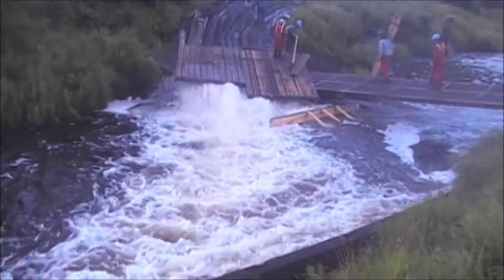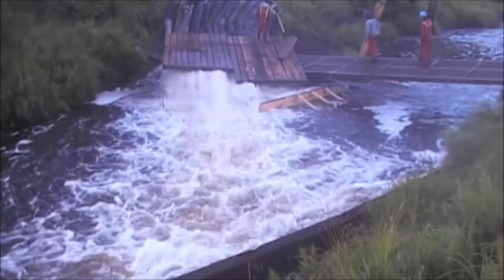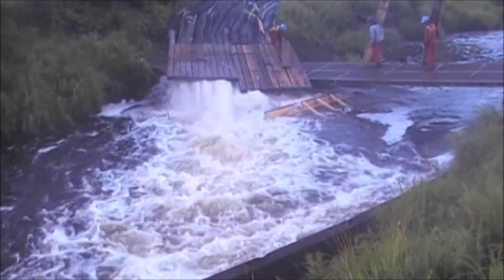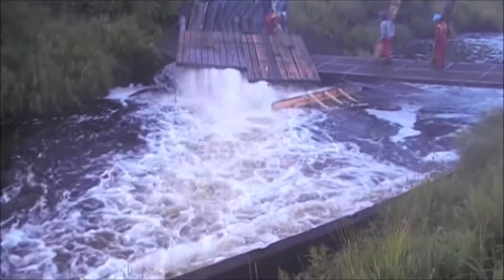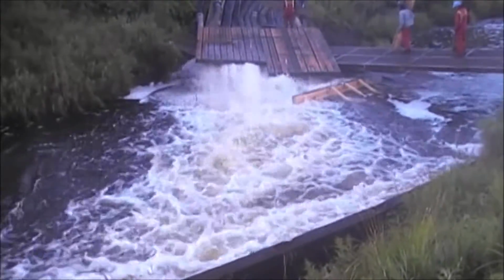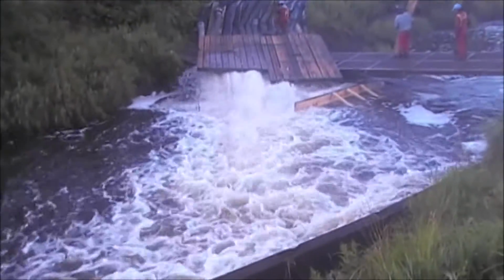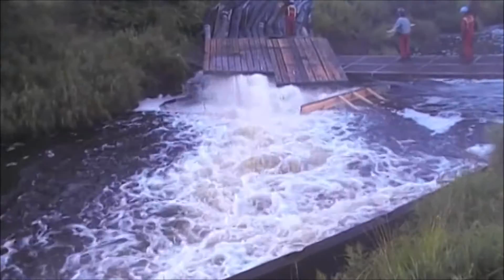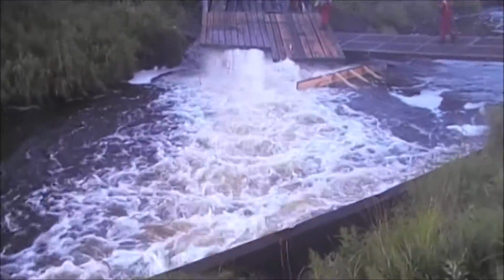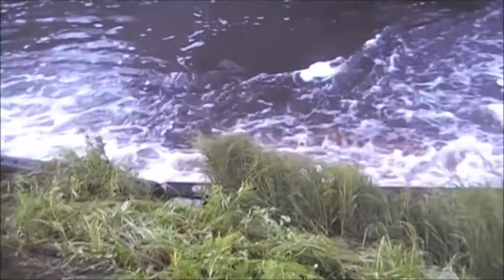This is the next day. All the pumps have been tried out. They left 6 pumps running all night long, so they've been running approximately 16 hours. This was to check water quality to make sure that it was up to snuff for the fish biologist, and it is. The turbidity level has not increased. It was 1, and they're allowed much more than that. It's a great job. We had to put a back drop in here, big, long. They're mats to keep the flow from eroding the bank.